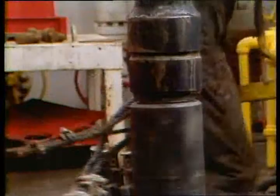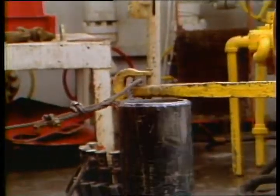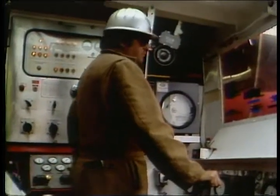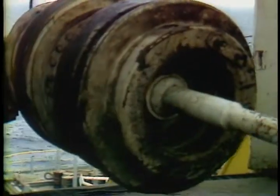The first stage of a blowout is usually a kick. A kick is usually preceded by a warning sign that there's something going on downhole. The driller is always on the lookout for signs of a kick — it could be a drilling break, flow increase, or pit gain.